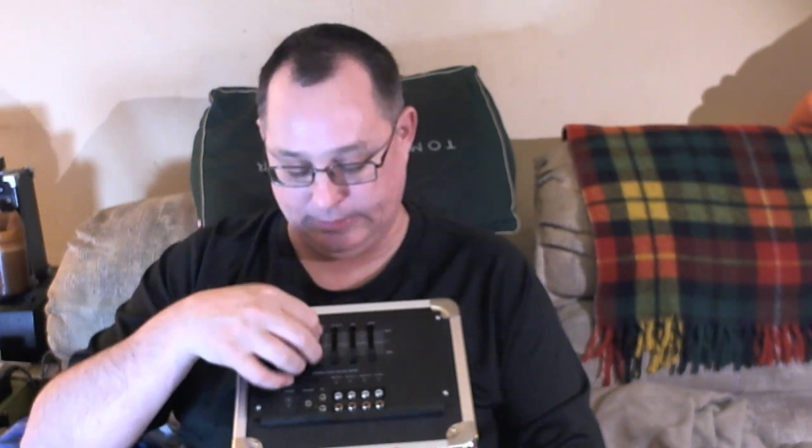So there'll be another jack with a foot switch, a cable that comes out of here that connects to the play and pause button of the MP3 circuit. We put a 4 count in the beginning, a couple seconds and a 4 count, and then we put time at the end, about 20 to 30 seconds of silence. So when we finish a song, we can change patches on our multi-effector, wipe your brow, pick up your pickup again, and sometimes it says the name of the song in a digital voice.